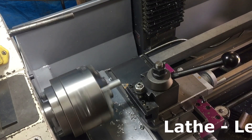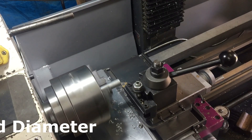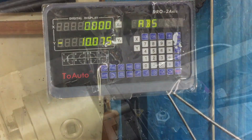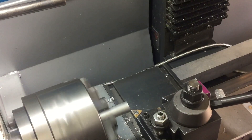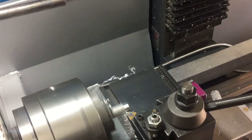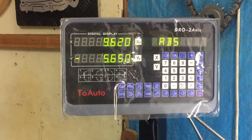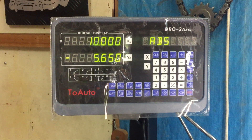At this stage I'm not at all certain about what the functions are for the lathe, so let's go for length and diameter. I'm just facing off and with the tool in that position I can zero the X, so I know that as I move the carriage along I'll be able to hit an exact length — theoretically. I start by engaging the auto-feed and when I get close to the length I want, which is ten millimetres, I stop the auto-feed and then manually do the last little bit. That worked and it was easy.